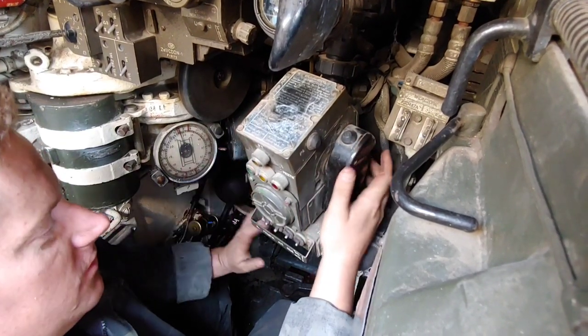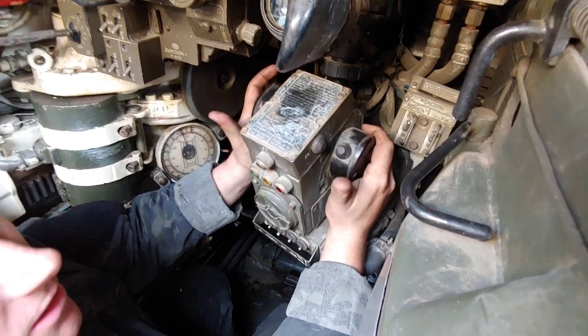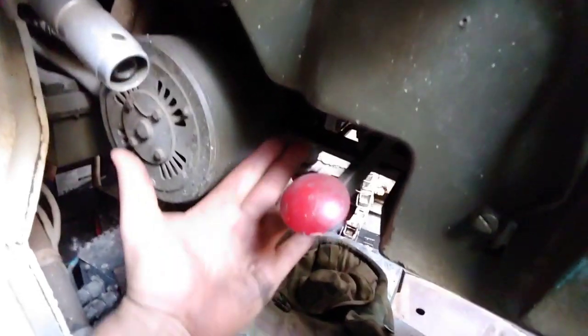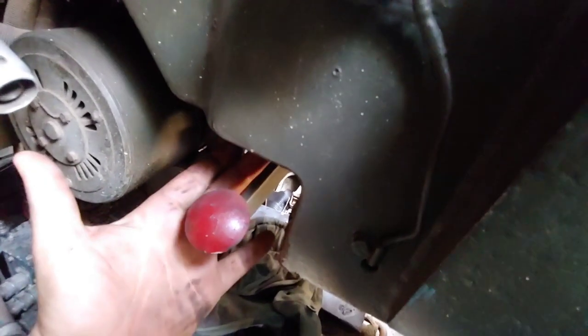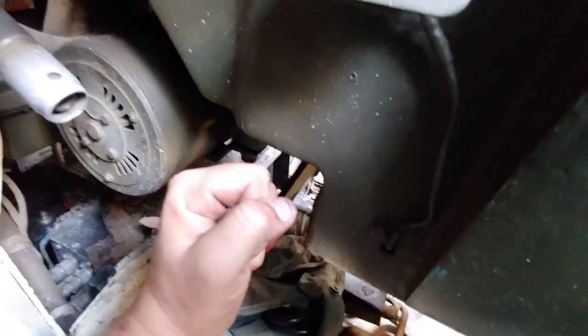All these other switches and functions do numerous things like providing an illuminated reticle. The electronic trigger on one side is main gun; the trigger on the other side is the coaxial machine gun. Down under here on the side of the gun is the trigger mechanism — up underneath is a solenoid. When the gunner fires his round, an electric solenoid trips the sear, which releases the firing pin mechanically. But if you have an electronic failure or system short, this here is the manual firing pin — you can engage that same solenoid manually by slamming on it.